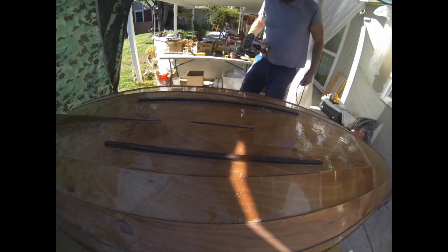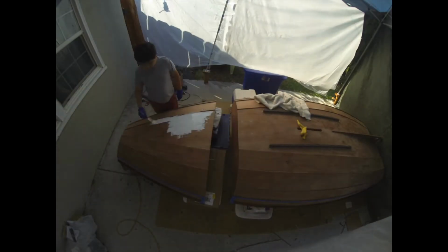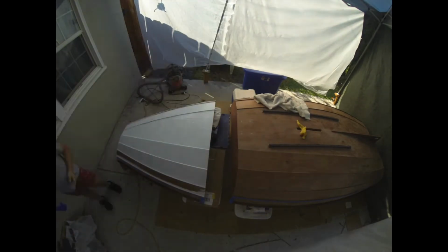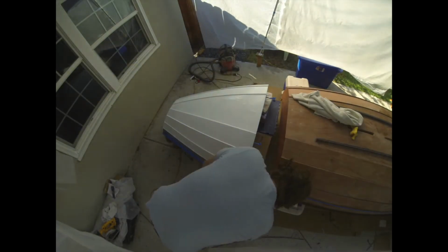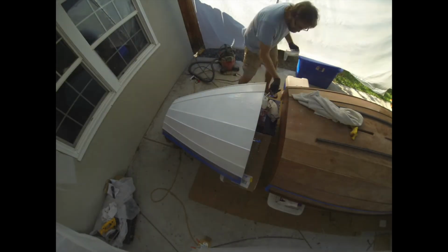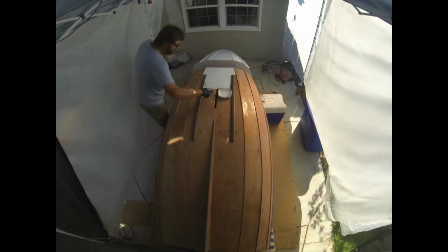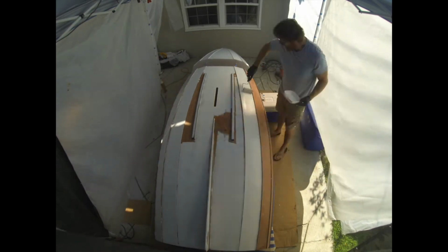And the boat is really looking good. Just so proud of the color. It's a shame to paint it. It was just so darn pretty. But to hide a few boo-boos, I decided to go ahead and paint it. This is the primer, which turned out to be unnecessary. It took a long time to dry, and to sand, I could have gone without it. So if you're thinking about building one of these boats, skip the primer, go straight to the Brightsides paint.